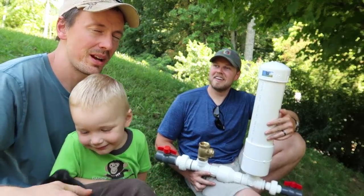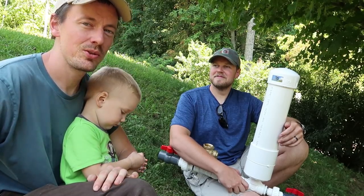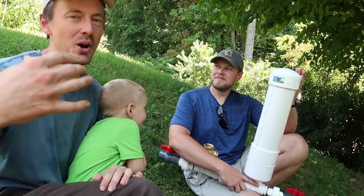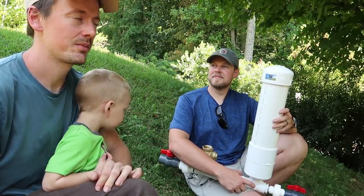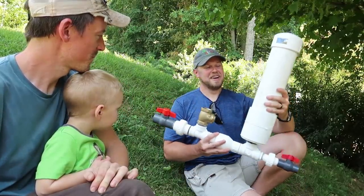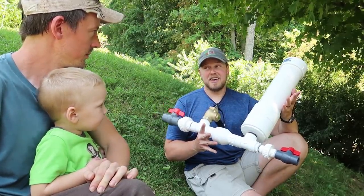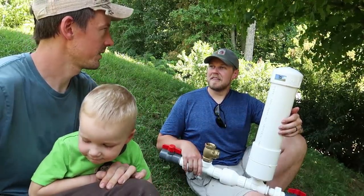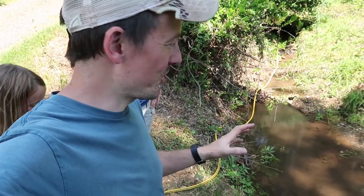That's amazing. So basically, ram pumps — the best way I understand it — a ram pump is pumping water using the power of the moving or falling water from your creek. It would be magical if you could pump all the water up, but you're actually pumping just a small portion of the water uphill and the rest of the water is released through the system. Is that accurate? It gets technical with the parameters, but best estimate about 10% is pumped — and honestly 10% is what you hope for. More like 5% is a really accurate level. So the majority of the water is going back into the creek.